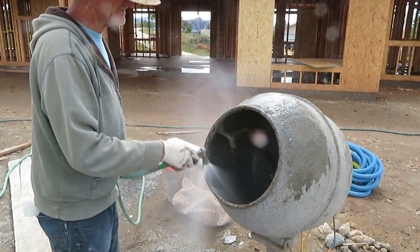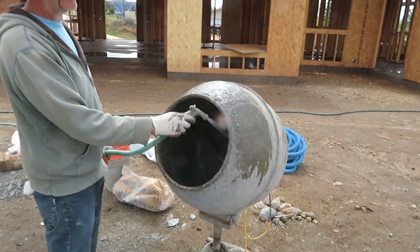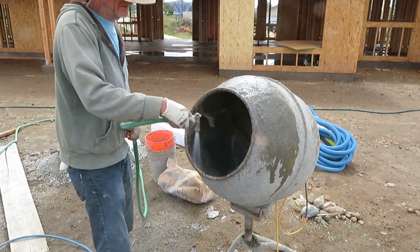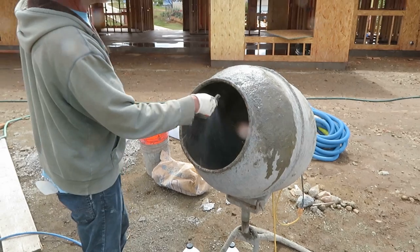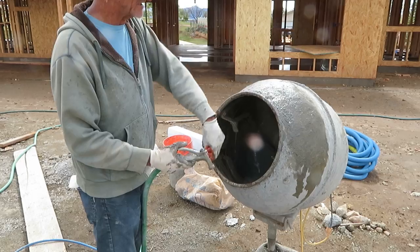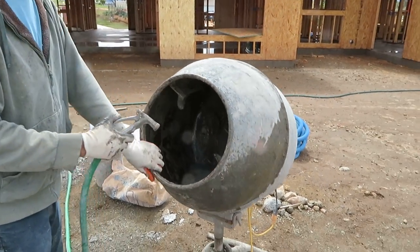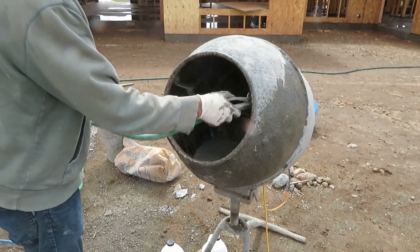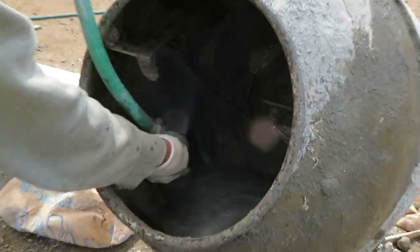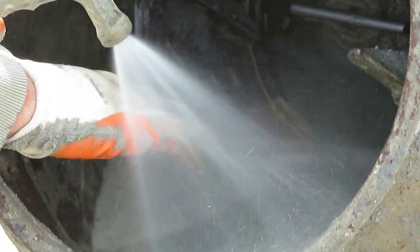Once you pull out all your mud before you go working, rinse the drum. If you don't, you end up with cement stuck to the walls of your drum and it just ends up being heavier to carry. You can bang it and knock it off, but it's a good idea to always get in the habit of cleaning your material off your tools before you go applying it. Get the inner edge — every square inch — around the paddles and underneath. Then you've got your water in there ready for the next batch.